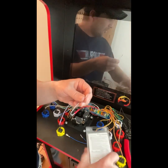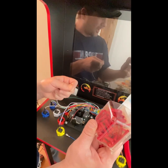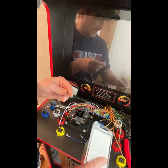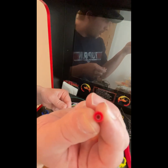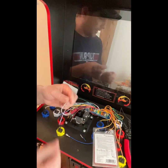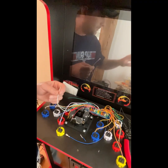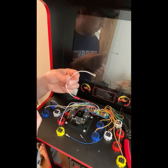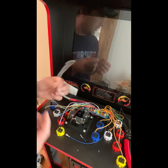So what I use for this are called butt splices. They are 22-18, in case you're looking for the size. They come in all different packs. They look like this. They've got a little hole in there on both sides, and it basically just makes an extender out of the wire. I put that together, and it extends your wire and gives you your clip. They may make other ones for these controllers that are 4-prong with 4 different wires hanging out of it. Honestly, I don't really know where to find those or what they're even called, so that's why I'm doing this method.